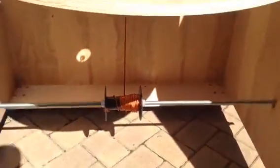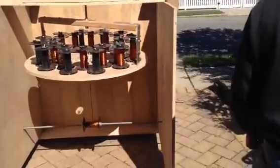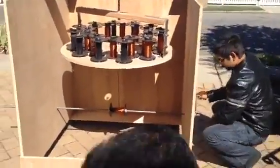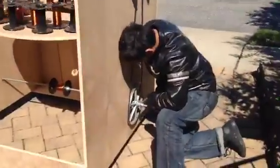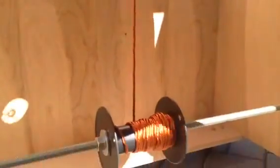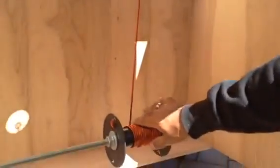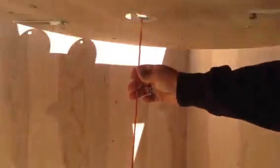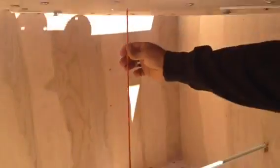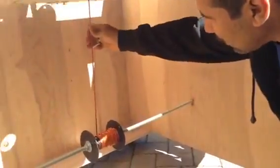So I'm going to demonstrate the machine working now. As you can see, the wire is twisting. I'm getting a nice twist here as it's wrapping around the spool on the bottom. This is what I didn't have before with the smaller pulley on it, so now I have the correct amount of twist on the wire.